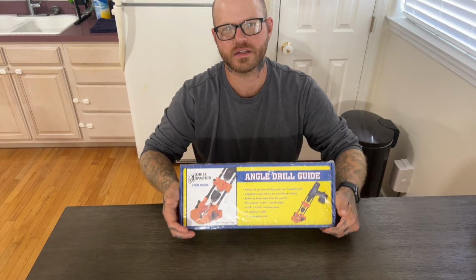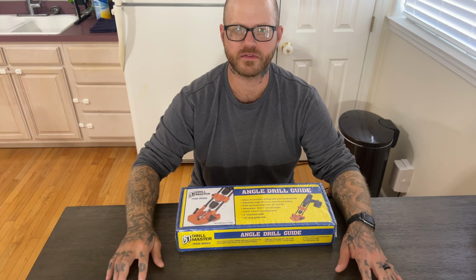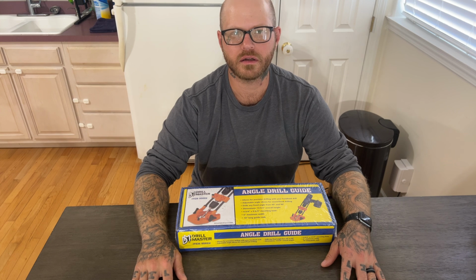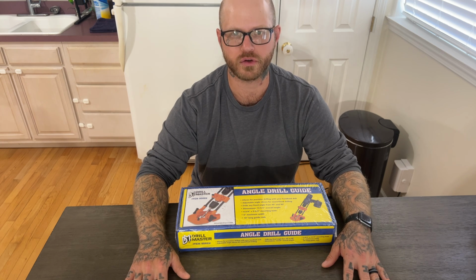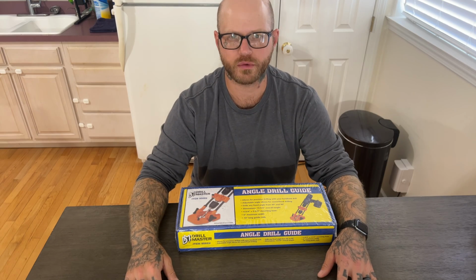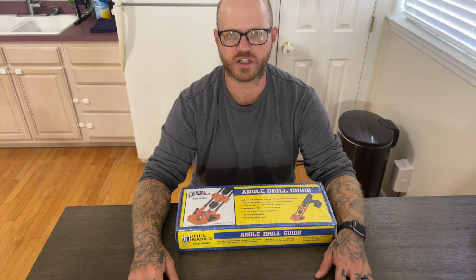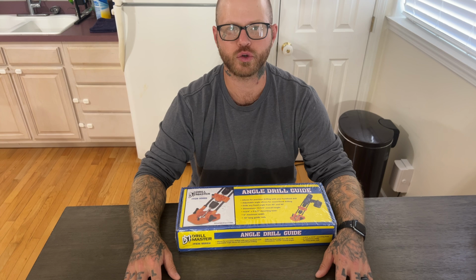Alright guys, so this is it. This is the Harbor Freight Drill Master Angle Drill Guide. At the time of this video, it was $14.97. It's supposed to be good for a 3/8 inch or 1/2 inch drill, and it's supposed to be accurate from anywhere from 45 degrees to 90 degrees. It claims to have positive depth stop control, and it's supposed to have spring return, so it slides back up like a spring action. It has a spindle lock for sanding and buffing applications, and it has a protractor for easy angle measurements in 5-degree increments.